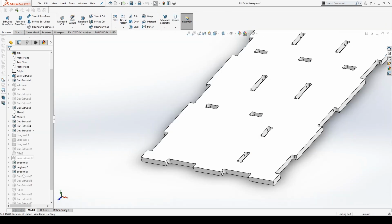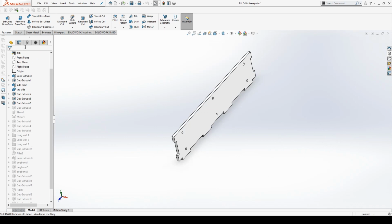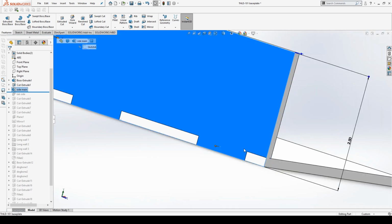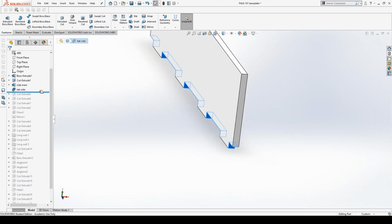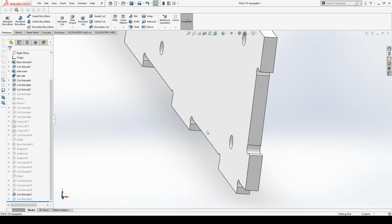You'll see I have a whole bunch of pressed things. That's because the way I did this, for each one of these, I would have a separate body deletion here. So if I roll this back, basically I would construct this as a separate body part without the tabs cut out yet, right? And then I would do a removal. So I would remove everything that the base is touching, which cuts out exactly the correct length tabs, because it'll cut out all the parts that the base is touching. So it'll make exactly the correct size tab, and it's a pretty good way to do it. This is the first time doing it this way, so that's why it's a little bit messy on the left panel here. But in the future, I'll know how to do it pretty accurately.